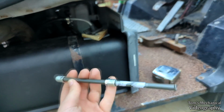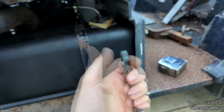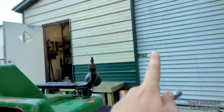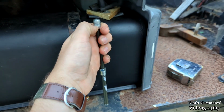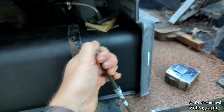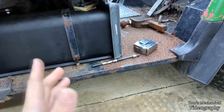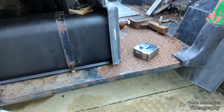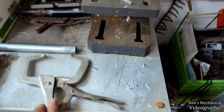And, well, I wouldn't have a way to mount anything onto the end of it, but, hell, if I could get some sort of, shit, I could probably just go buy like a 5/16 fuel line coupler, take that other scungy piece I've got and just ignore those brass fittings I have, run this straight up through a plate, mount the coupler to it, run it flush, tighten it, and then have that connected. Shit, I might be able to do all this with off-the-shelf parts. All I need now is a 5/16 brake line coupler. I think we're golden.